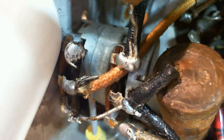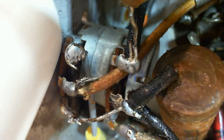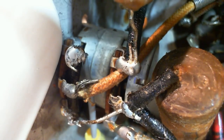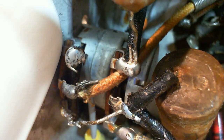So these kinds of movements in the long, long run lead to failures in radios of all sorts, including, more commonly, in modern electronics where the components are mounted on a board. Often the volume controls and things like that are soldered to the board, and that's it for their mechanical stability. So when you work the control, you can transmit some movement, and in the long run, you're going to have a cold solder joint or something show up. Okay, soldering iron must be hot by now.